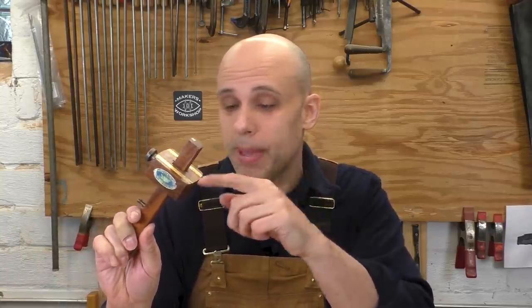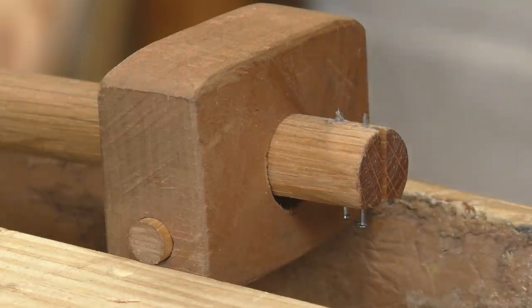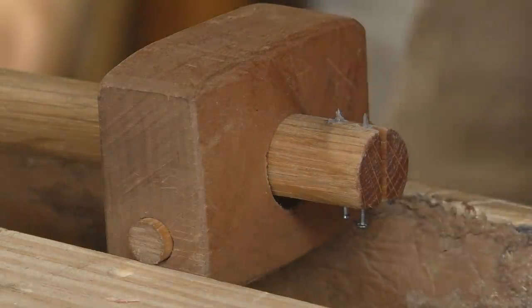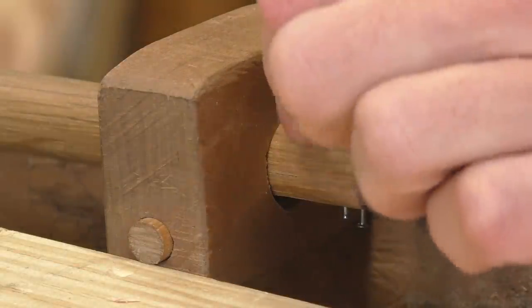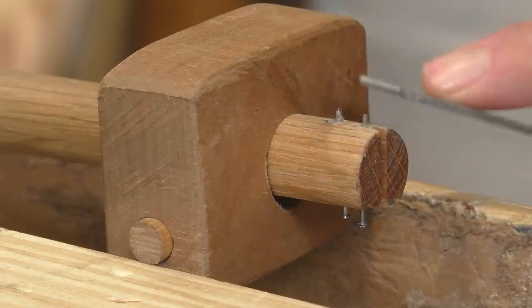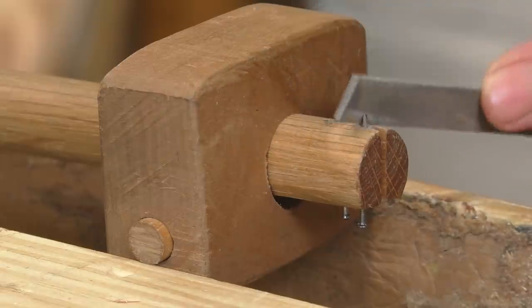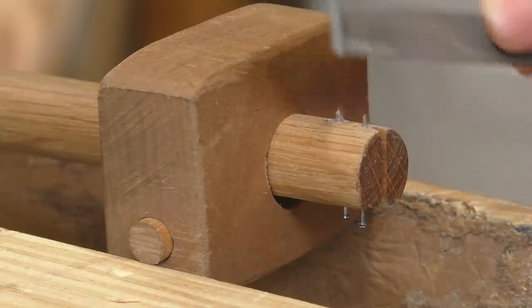You're probably also thinking that you need one of these fancy adjustable mortise gauges with a bunch of different pins and all the stuff — but the good news is you don't need one of these at all. Just grab any old marking gauge and add a second pin. I made this gauge last year, and I just glued in a finishing nail about 5/16 away from the original pin. Nails are good for this style of gauge because they're flexible. Bend the tips until they're close to your chisel, and then file them until they're dead on.